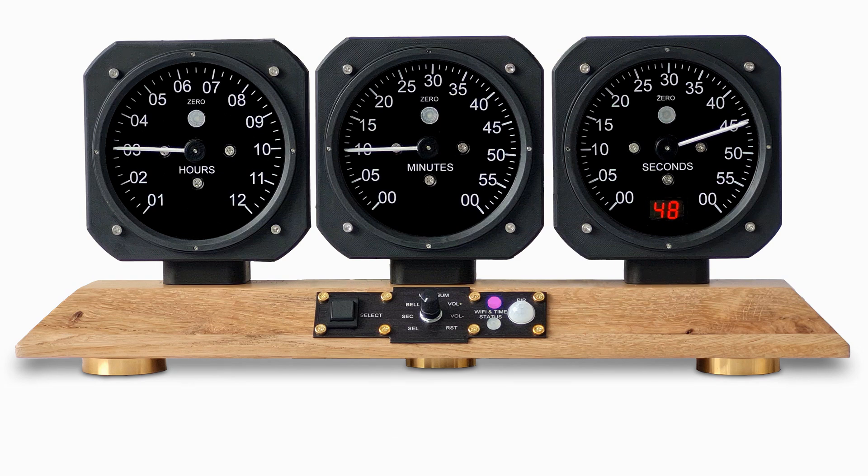In this example, the seconds motor attempts to zero at the end of a minute. The hall effect switch has failed and the seconds hand shoots past zero. The microprocessor detects the hand has made more than one revolution and stops the clock. The red fail LED flashes to show the clock has failed due to overstepping.